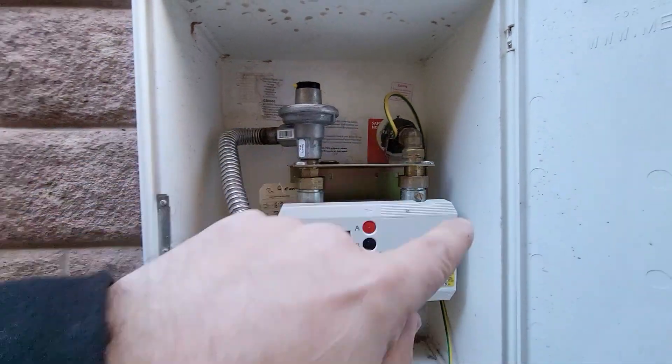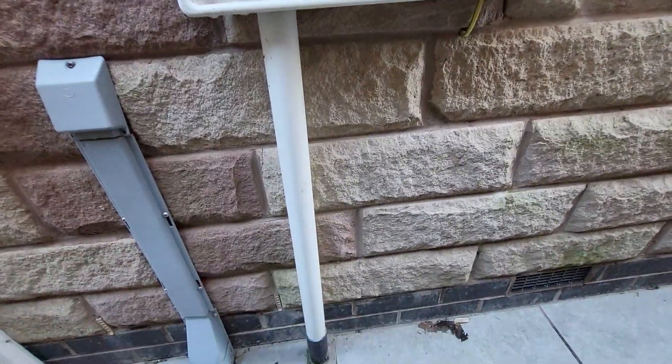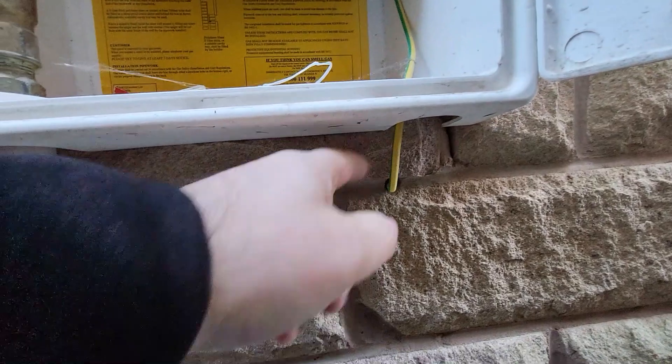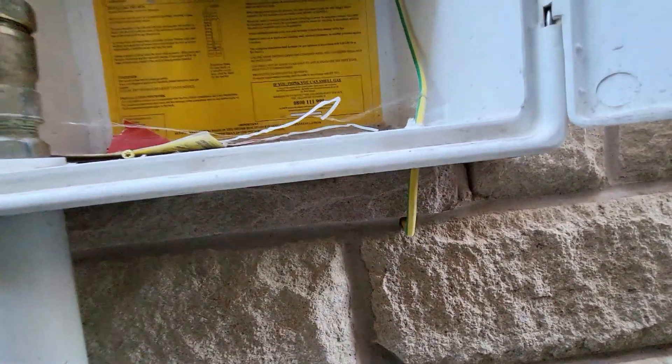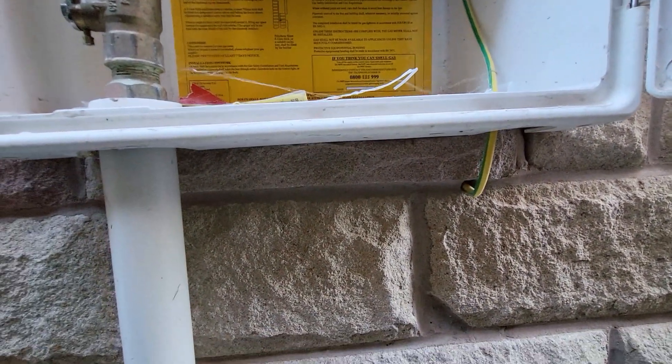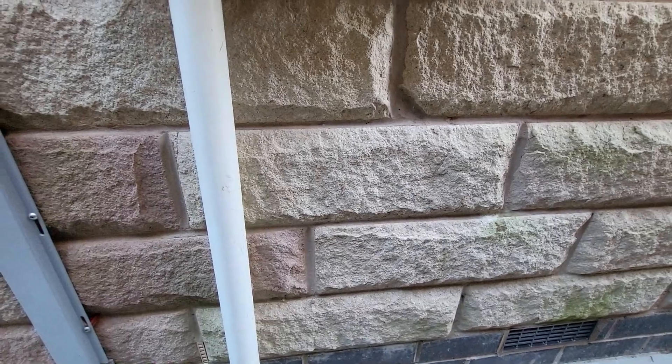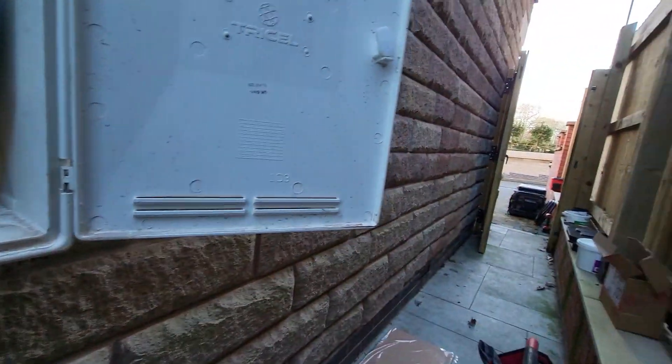You can see that's where the gas pipe passes through that wall. If you look down here we're clear of the main gas pipe, and the water pipes - we've got a clue with this gas bonding cable that's been drilled through, so we can look for that on the other side as well. If you can see that anywhere it gives us another idea that we're in a safe place to drill through as neatly as possible and get on with our cable route down to the charger.